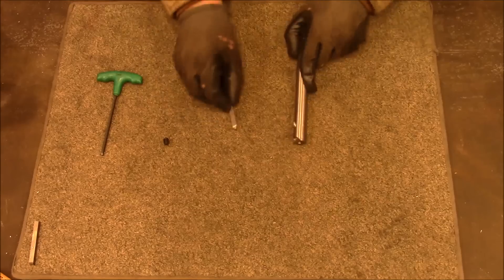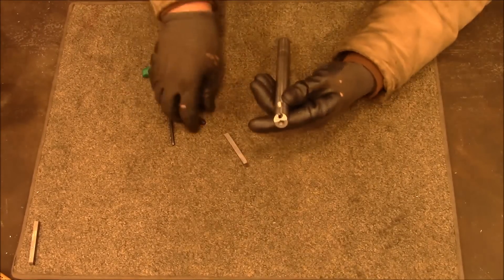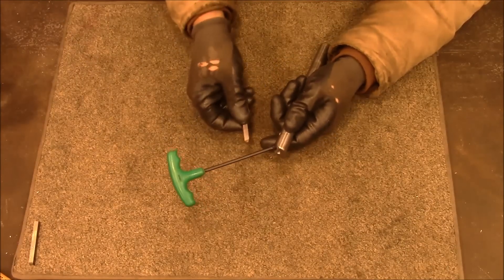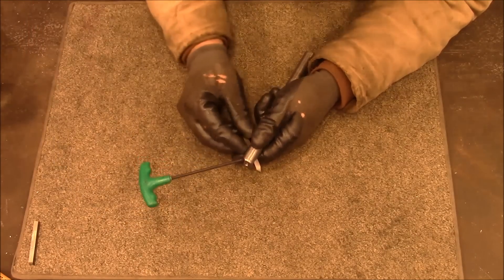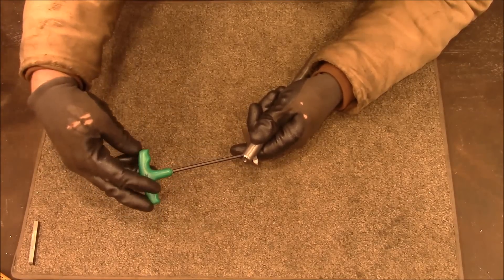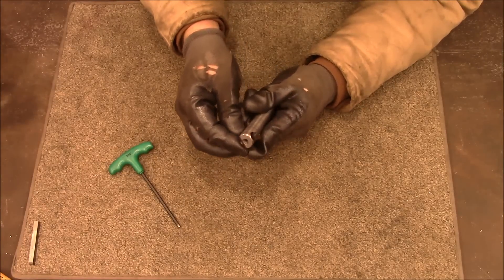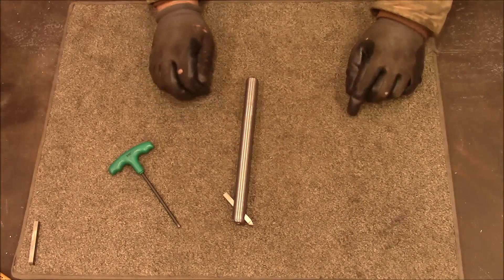Let's get it put together. Here are our parts. This is a tool bit — I just modified it just a little bit to match these angles. We're going to put our set screw in there and put that bit in there. Have it stick out prior to the end just a little bit. That set screw will kind of square this up — kind of drew it up in there — and tighten that down. Hopefully that will work really well. Thanks for watching.